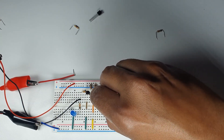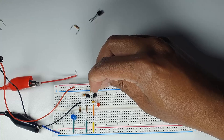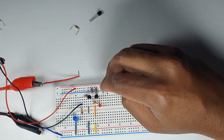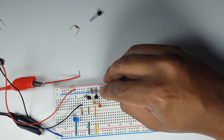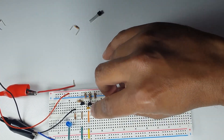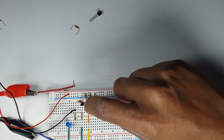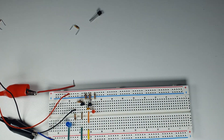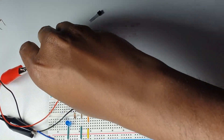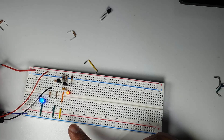The output is on this line over here, and what I want to do is have an LED on the output line. I'm going to connect this LED to this side over here - that's our output indication LED. I want to have the resistor going from 5 volts to the LED, and the LED is connected to the collector of the transistor. So whenever the output pulse is positive our LED should be on. Let's connect up 5 volts and see what happens - I press the button and the blue light comes on.